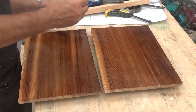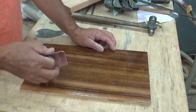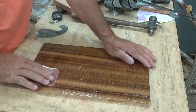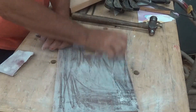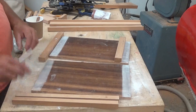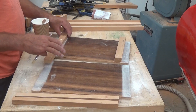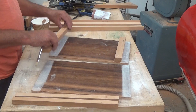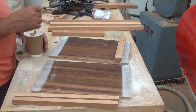I have two coats of epoxy on these side panels of the daggerboard box. I'm going to scuff this up and add a couple of coats of varnish as well, so the centerboard will slide in nice and smooth. It's time to assemble the box. I had to sand off the varnish on the ends where the inside bracing was going to go — you can't glue epoxy to varnish. I could have put masking tape on there when I varnished but I forgot, so now I'm just going to brush epoxy on all mating surfaces.